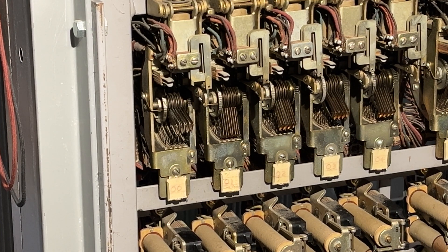Part two of the AE, better known as Automatic Electric Strowger equipment. In the very early days they had a phone line connected directly to a selector, which the phone line would be idle 99% of the time — a very inefficient operation. Later on they devised a rotary line switch, and this here is probably the second or third generation.